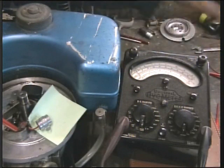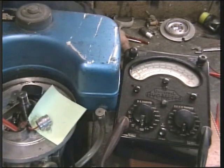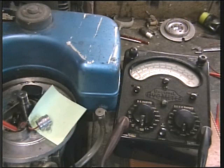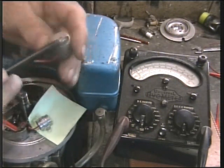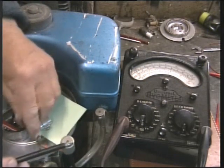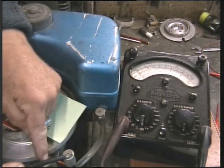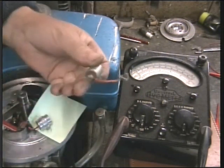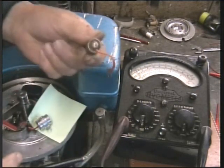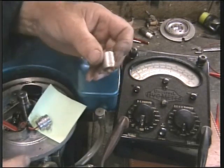So I think that might be a bit leaky, but they vary. I'm assuming that's a 0.1 microfarad and I've got a box of similar ones here — they're all of that value. So I'm going to take that one. I've already checked it. If I put that on the earthy side and touch this on the body — watch the meter — it cocks up and jumps down. That's about right for me. I'm more happy with that. So I'm going to put that capacitor in place of that one — it's got to be about the same value, it's not critical. So we'll see how we get on.